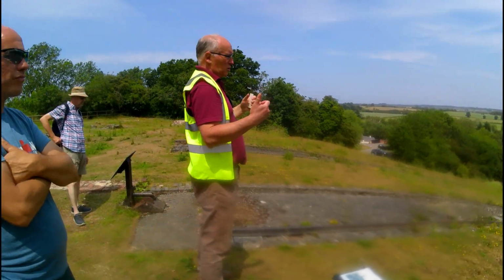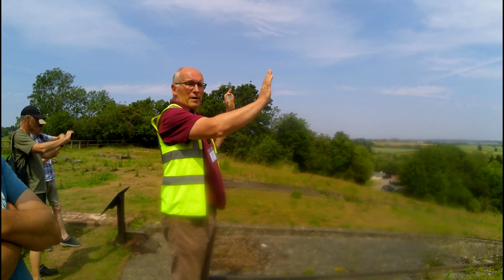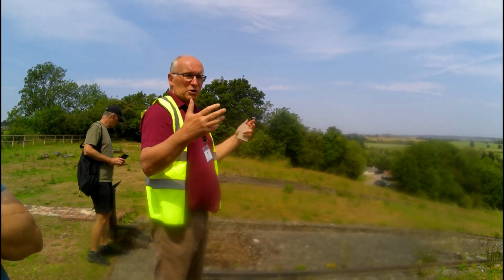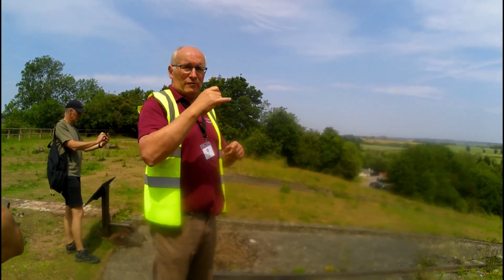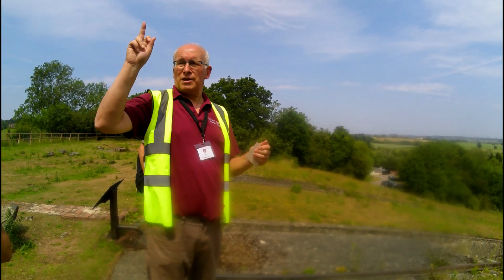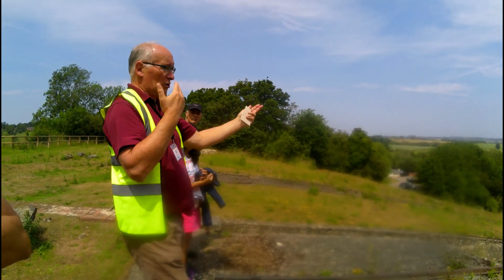73 feet from bottom to top, one in force halfway down, one caisson coming up the slope, one going down on the other side, and vice versa. We're a balanced pair. Due to Archimedes' principle, which means that when you get into your bath, you displace your weight in water. The caissons, it doesn't matter whether they've got no boats, one boat, or 2 boats in there, all going to weigh approximately the same. The major difference would be if the levels in the canal up here were different to the levels down there. The water level could cause an issue, but the caissons themselves weigh the same.